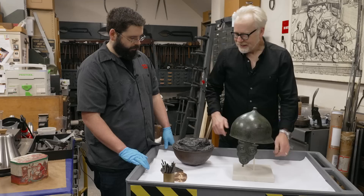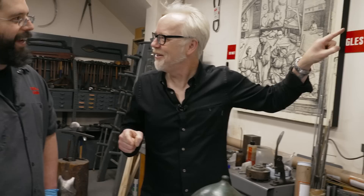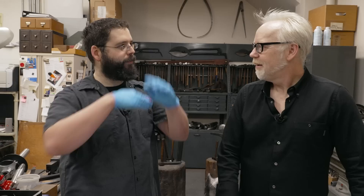I'm imagining you sitting here with this pitch and hammering, and maybe something goes wrong in a way that tells you, 'oh, that's why that mark is in that piece of armor over there.' I love getting one actually in hand and looking up close — you suddenly feel better about yourself as a craftsman when you can see an actual professional is having the same problems you are. Terry English, when we were making armor in Cornwall, told me he doesn't measure the rivet spacing because there's no piece in the royal collection where they're at all consistent. He said, 'I use calipers, but just that.' They were doing everything by hand and by eye, and you get some things that are wonky — the comb and the visor slits are slightly off from each other — and it was just the way things were. They accepted it.